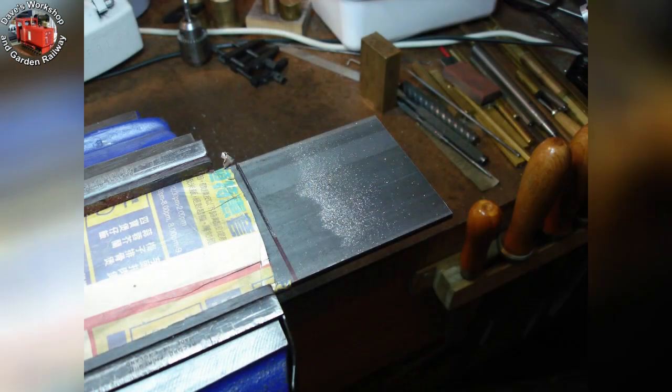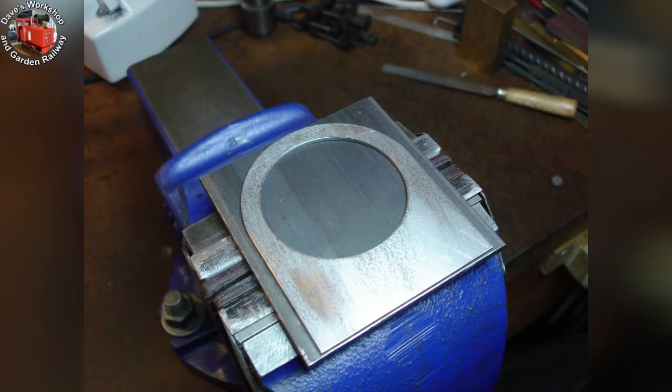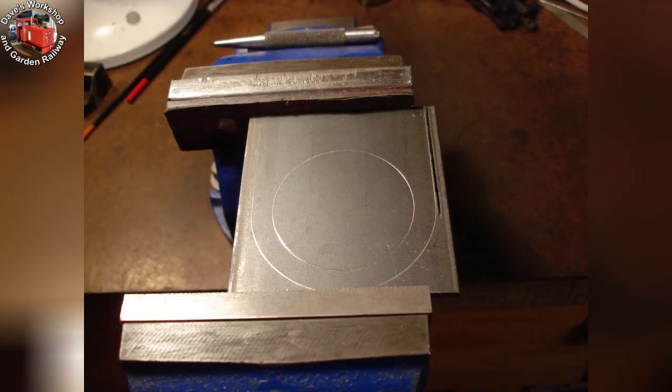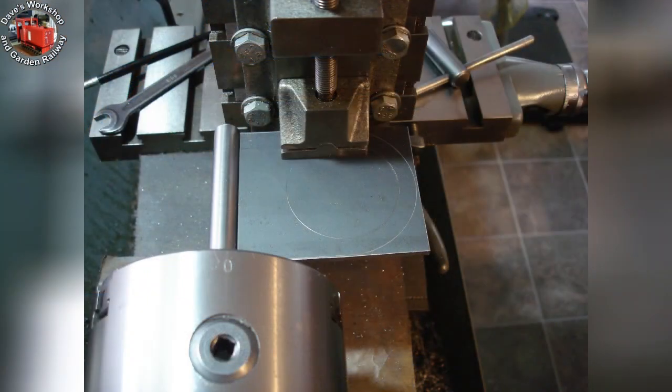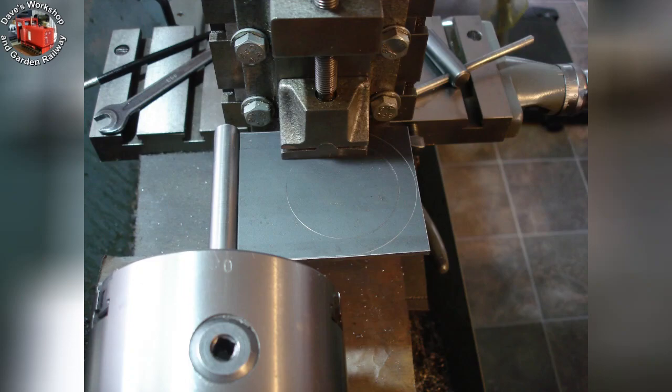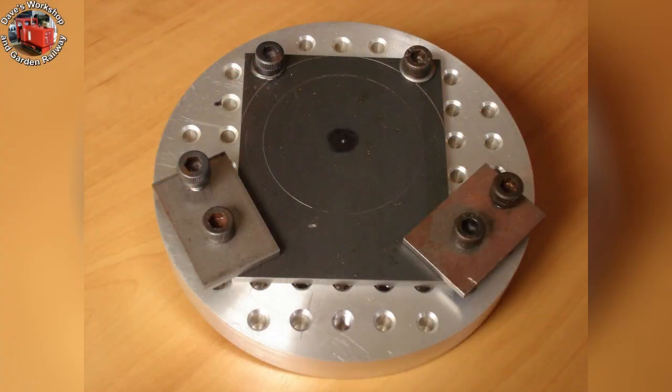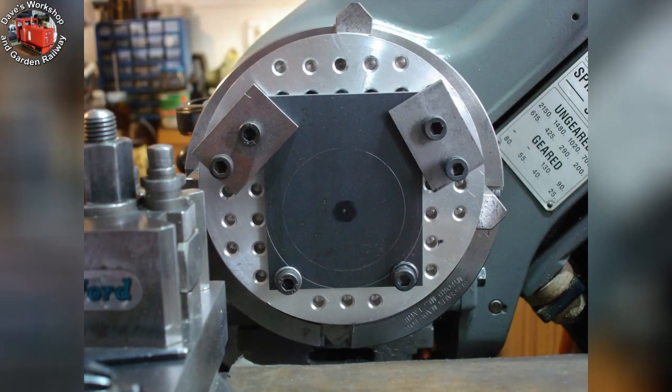Now it's time for the smokebox back plate. I decided to use the 4mm hot rolled steel — thicker to provide a better push-on seal for the boiler barrel. Ready for marking out, using the front plate as a template. The heavy scribing is easily visible. Hack sawing to the line, squaring the job up for milling the second face, then fly cutting to finish the height. The smokebox back plate is fitted to a faceplate for boring, because the four-jaw chuck would crush the thin wall section at the top. Set to center height in the lathe; I used the wobbler bar and dial test indicator again to clock it up.